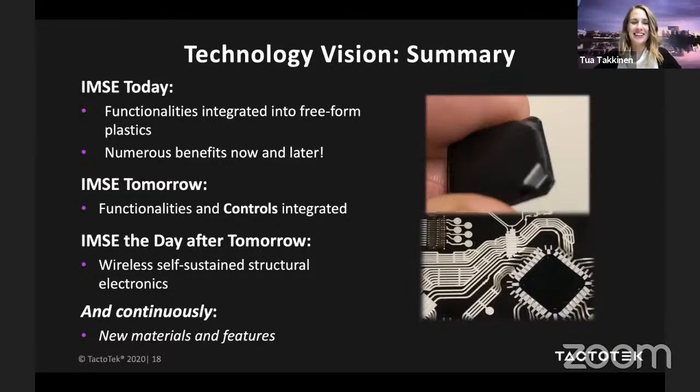Okay, thanks. And then how do you realize the IMSE system in package components? And I think this refers to making the components. The components are off the shelf. So PCB is traditional PCB. It's a normal PCB, no problem with that. And the components are off the shelf components. So we are making that sub-assembly. And the process itself, making the plastic cup and filling that, it's a very simple process indeed. So make a plastic cup with thermoforming and dicing those and filling those.